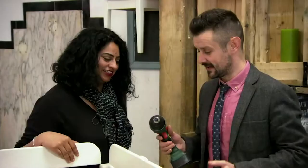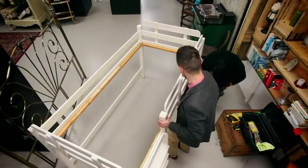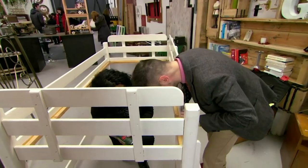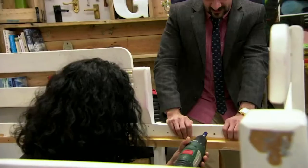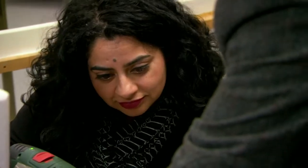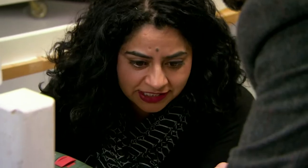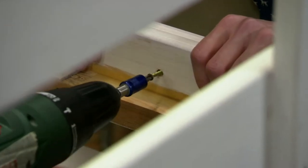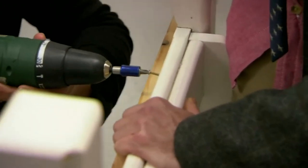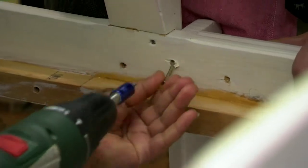I'm going to take you completely out of your comfort zone and introduce you to some simple hand tools. It won't hurt you. You just press the trigger, it spins. Good — solid furniture like this is brilliant for upcycling, because it can be taken apart without damaging it. Let's start on that screw there. The tip is to push, even though it's going to come out — keep pushing as hard as you can. Well done, but the bad news is you've got four more to do. Applying pressure stops the drill from slipping and damaging the screw head.